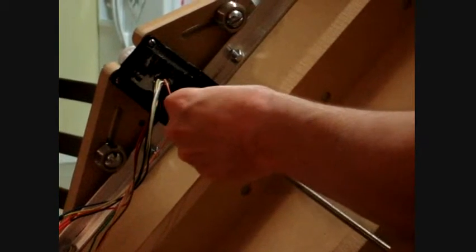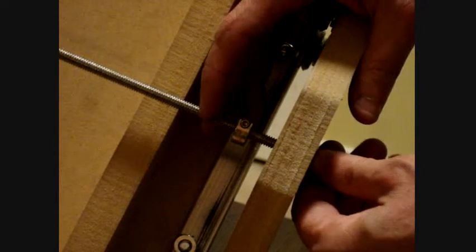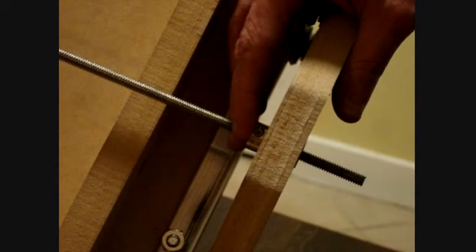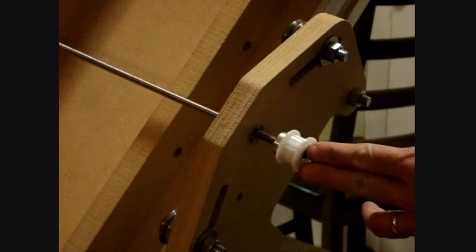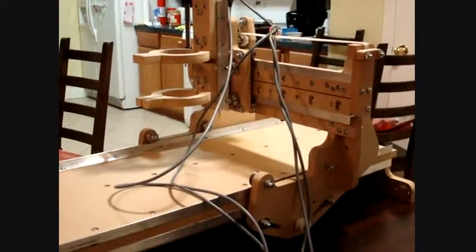Use one of these spiders into the coupling. Get the other coupling and put it on. Take this collar and put it up against the board — not too tight, just loosely. Then make it really tight. Make sure it can still spin — it can still spin. Attach your drive pulley onto the shaft. Add 3 bearings on this side and then 3 bearings on the left.